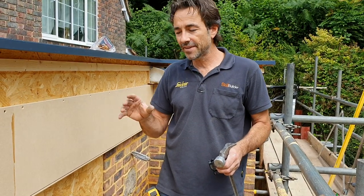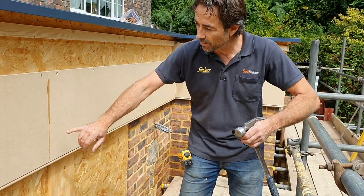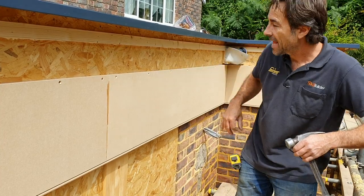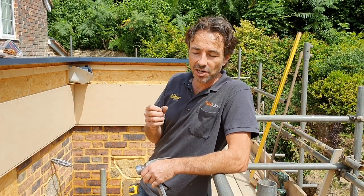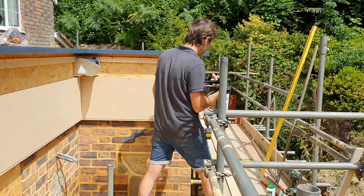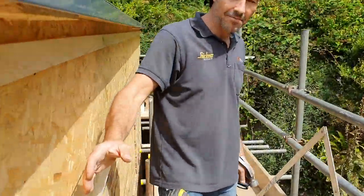We've got a technique going on here — it's moulded in one piece, so there's a little cock bead at the bottom. We're using a biscuit joint which is routed in, and we're mitering the internal and external corners. Normally we'd put a scribe, but there's no way you want to scribe all of that, so a mitre will do. We're using a really good PU exterior glue, and I'm going to show you how I cut these mitres perfectly.